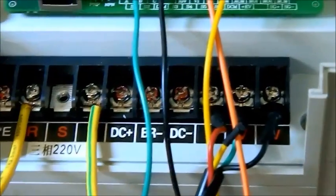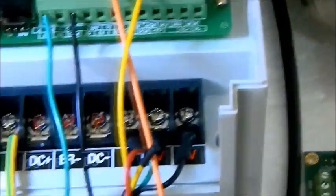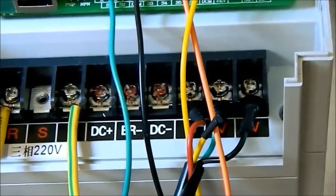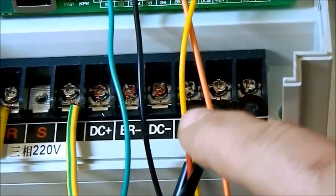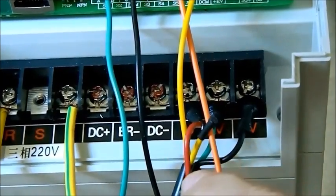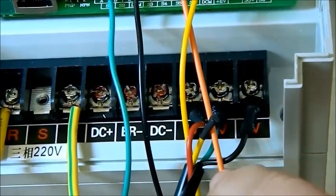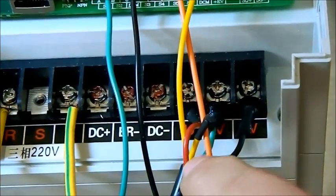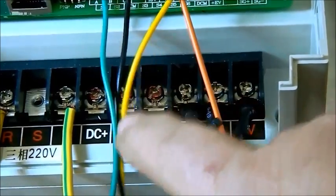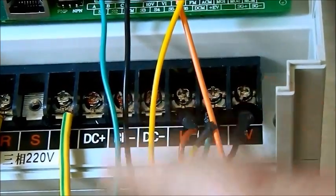Then, here we have made one cable for the spindle already. The cable is for four wires: U, V, W. It's red, green and black — in this order going to W. The yellow color here is the earth; we didn't connect it now. And it goes to the spindle connector on the backside.